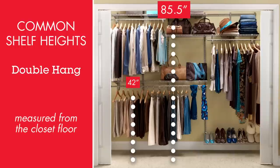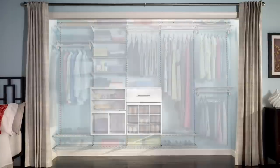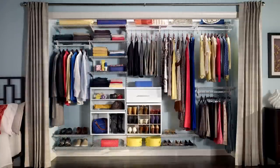And another shelf at 42 inches. You not only maximize your closet capacity, you build in a whole lot of convenience. For long hang space, while it may be tempting to set it higher on the wall, a 70-inch height makes sure you'll be able to comfortably access even the heaviest coats and clothing.